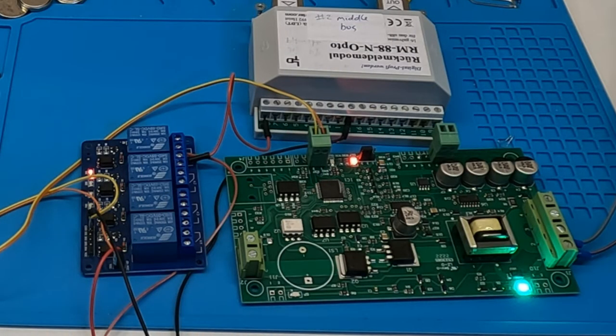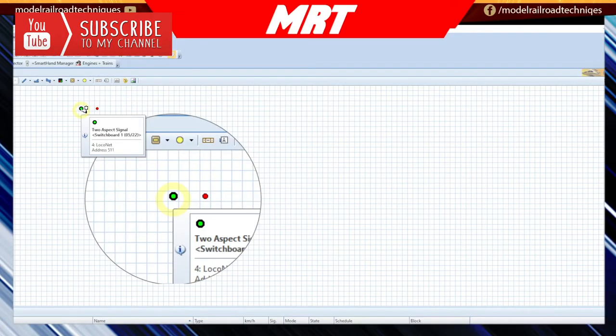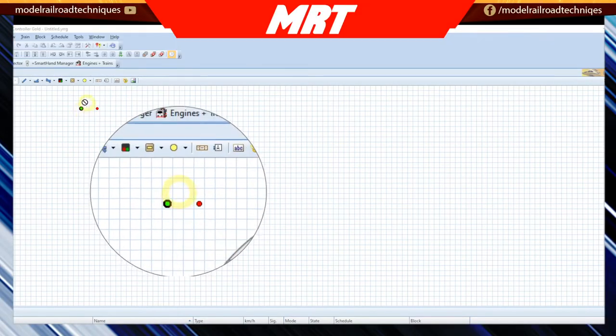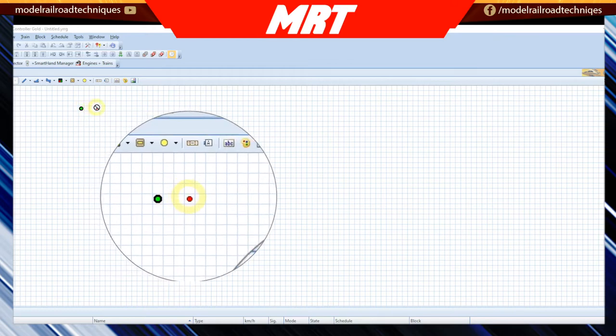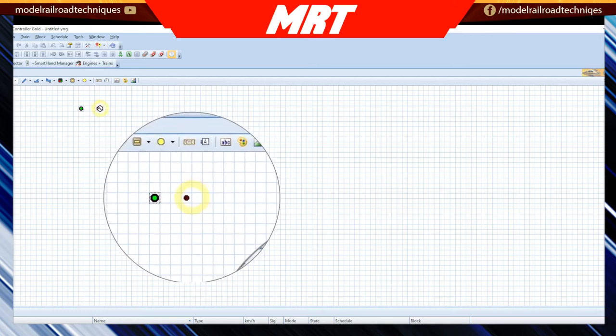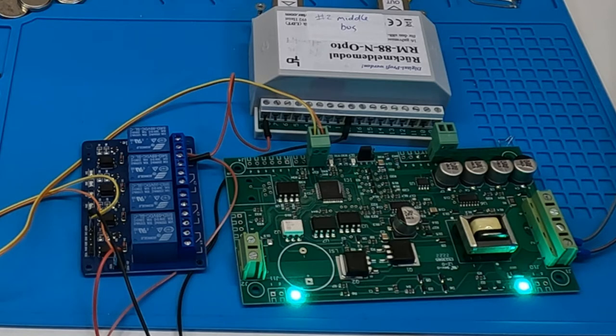As you can see we're in short circuit mode here. The indicator is on, and we're also firing off on the relay side. Jumping across to Train Controller — on the left-hand side are very crude buttons within Train Controller, but the sky's the limit for what you design. That button there controls DCC to turn the board on and off, so we can turn individual boards off. On the right-hand side is my short circuit alarm. Within Train Controller you can have a little fun — once it goes to a short circuit you can put other automations in, such as triggering an audio file.